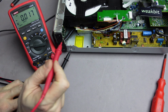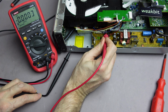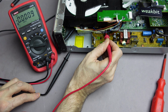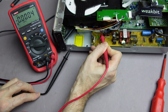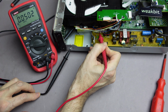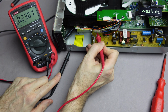What we see here is the measurement instrument. I would like to measure the pins now. You cannot see that directly, but it is here. What is here? 020, 026. Okay. 5 volts. We have here 0 volts, and here we have 5 volts. Okay, looks good. 0 volts, 12 volts. We have here 0 volts. And what is here? It is nothing, huh?